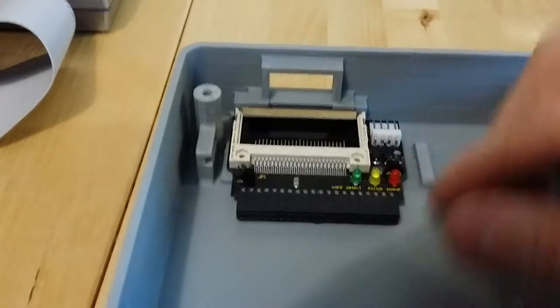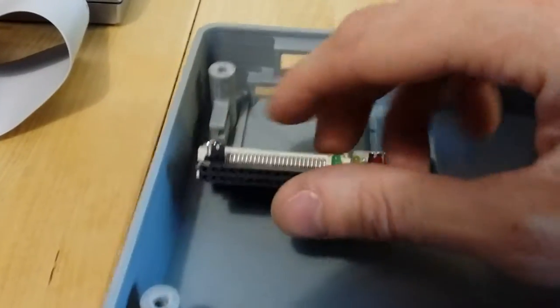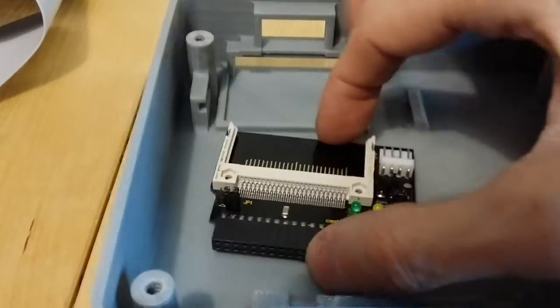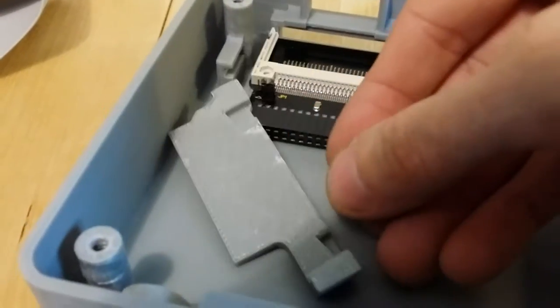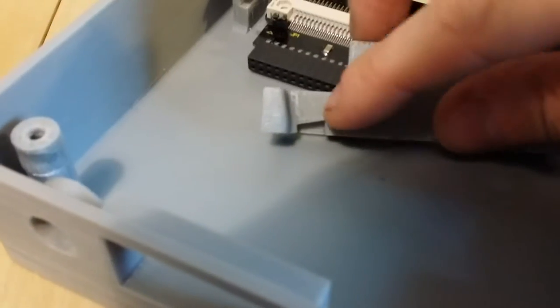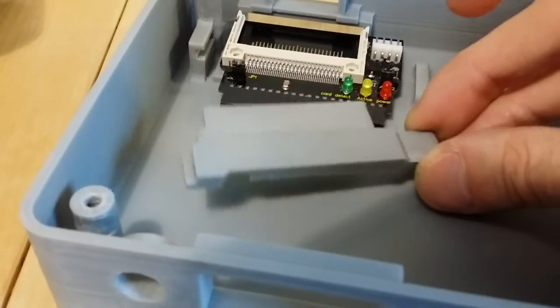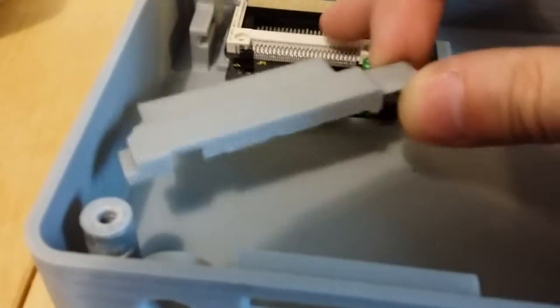Those two pockets provide the clearance for that jumper and that jumper, so that the part can swing and doesn't bang the jumpers over. And that funny looking, not square looking shape, where that's at an angle and that's at an angle, that's on purpose so that when this goes in like this, it can swing like this and still not interfere with the card reader.